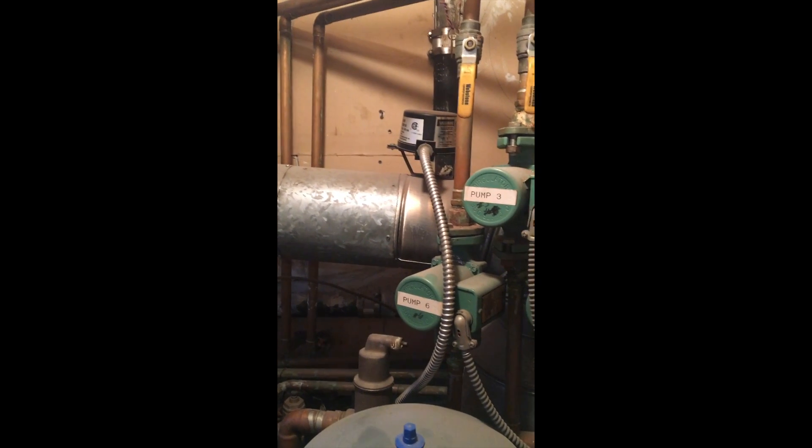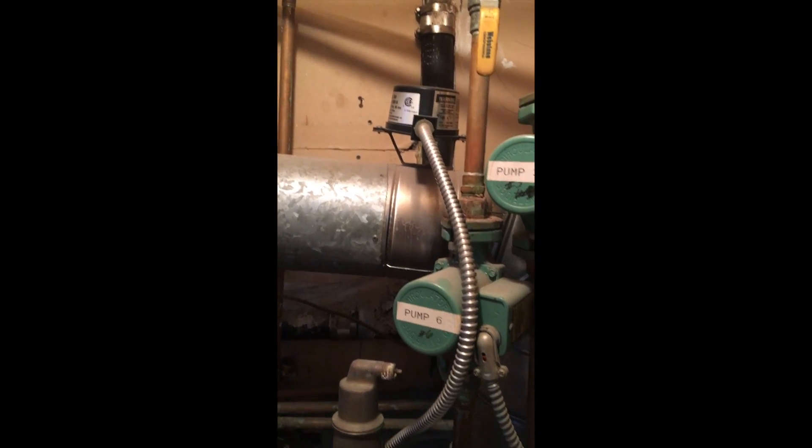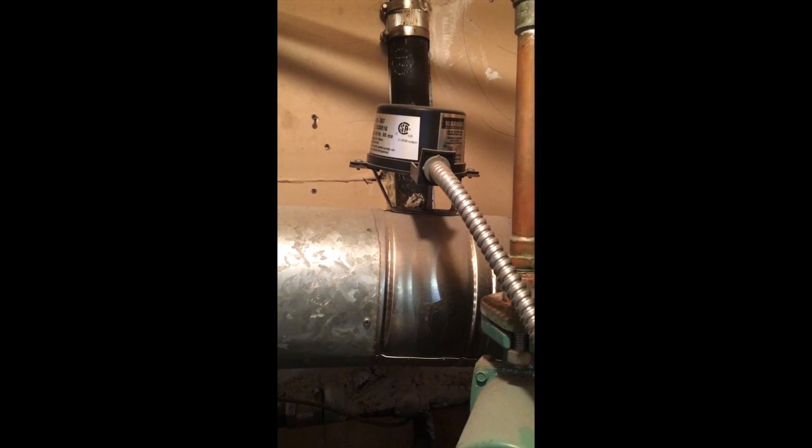It is installed in a horizontal position right there, going into the chimney. If you notice, there's our draft diverter, and it is normally right around there. In this particular case, because there wasn't enough sufficient pitch, they put the 90 there and put the damper there. We get a lot of service calls, especially throughout the winter, for this damper — which is made by Field Controls — being stuck in the open position.